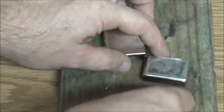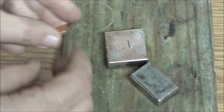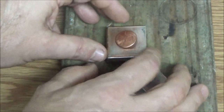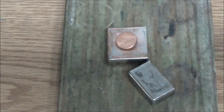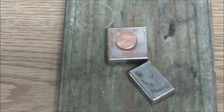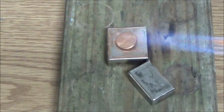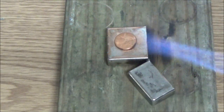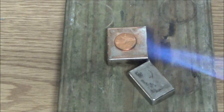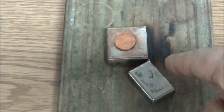We'll leave that open, and I'm going to set my little piece of solder down there wherever I want my penny to be. Now let's fire up the torch — you're going to want to heat on the inside of that thing. This is probably overkill, but you're just going to want to heat that and just keep heating the inside of it. If your torch doesn't go out like mine does when it's full — and you see how it just dropped down on its own, it fell right down. That's all it takes. Shut your torch off.